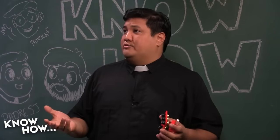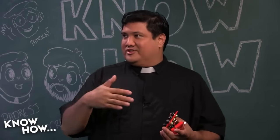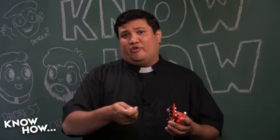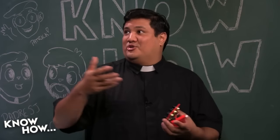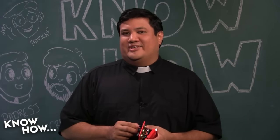One thing we will do here is we're going to add a power disconnect. You may remember from our Aquavase project, there is a shortcoming of the Nano versus some of the other Arduinos, and that it's not really good with power. What I mean is, if you have your power circuits tied in and you don't have a diode in there to stop the reversal of power, when you plug in the USB, it actually tries to power the entire circuit off your USB bus. That's not good. That actually burns out the Arduino.